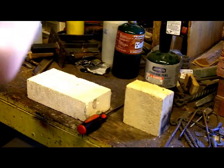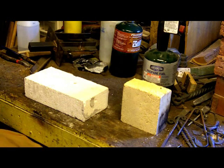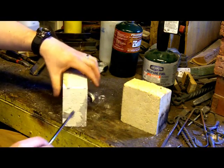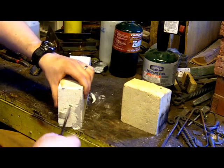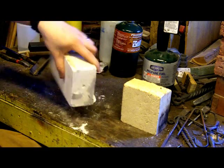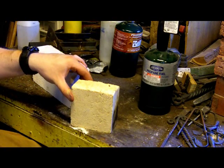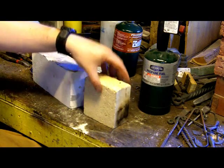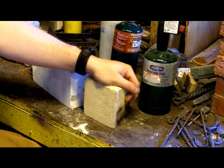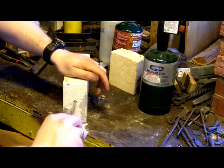The differences between the two — hard brick and soft brick — they're both available through places like Seattle Pottery Supply, that's where I get mine, they're local to me. Soft brick, when I go to dig in the end here, you can see the screwdriver pretty much goes right in and starts making a hole, no problem. The hard brick, no such luck. Hard bricks are great for building the openings of your forge, very sturdy for long term use. But for something that needs to be shaped, the soft brick is definitely the way to go.